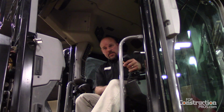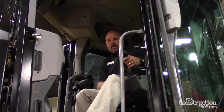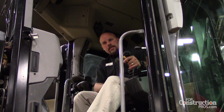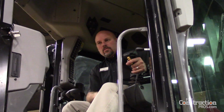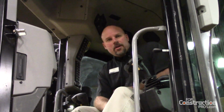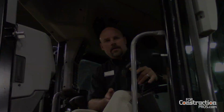It's still fairly easy to do, but depending on what kind of work I'm doing, I might be coming to the end of my run, and I want to start to lift my blade up, articulate, and steer into the windrow and kind of feather that material out. That's three things I'm trying to do at once. So customers said, you know what would be simple, even simpler? Give me a button over here to turn on auto articulation. And so now all I have to do is steer the tires and it'll automatically articulate.